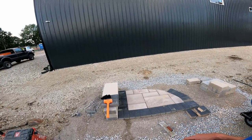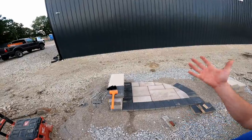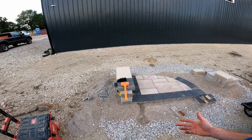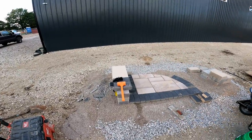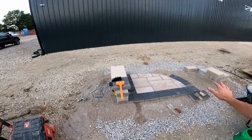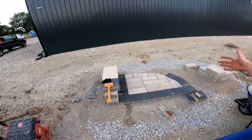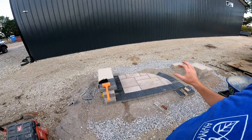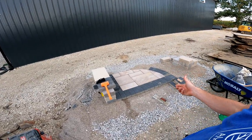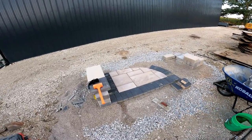On dense grade base, we switched to concrete because we would come back to jobs and find sections of plastic edging heaving up out of the ground after the first year — while other sections sat for 20 years without any heaving. It wouldn't always be where water congregated or soils were spongy. There's something I'm missing as to why it does that, likely related to soils and moisture.